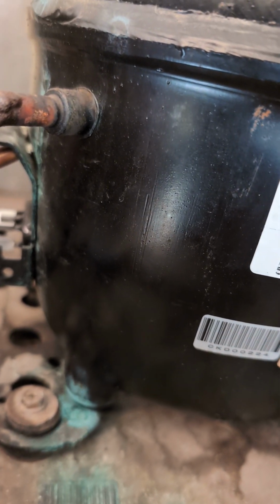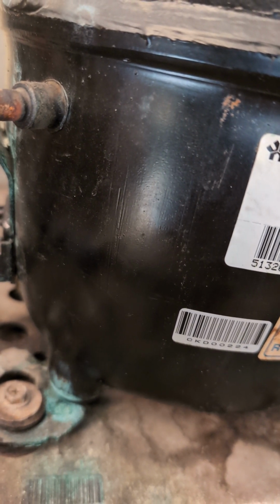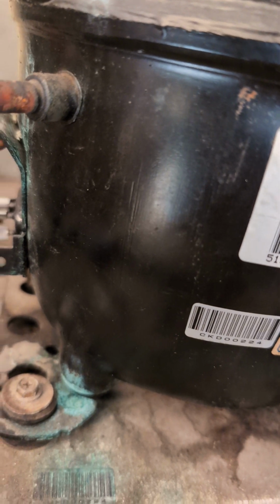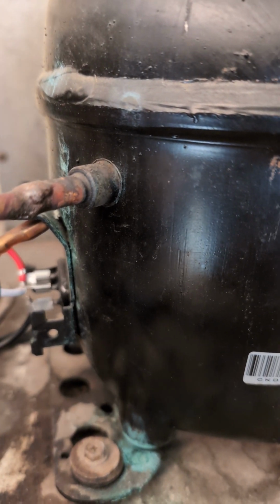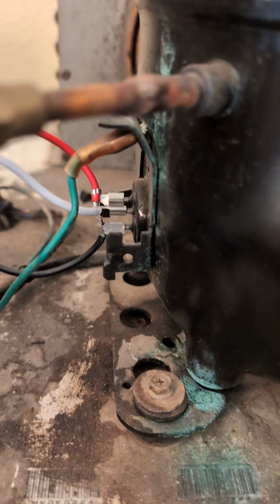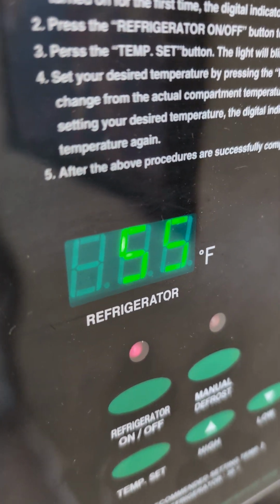But here's a little information. There's a site called outforgrabs.com, and you can actually get a capacitor that is similar to this, but it has a connection that just snaps on there on all three. So it's got the three holes, and you don't have to worry about bad contacts and shorting the compressor or anything like that. So that'll work pretty good for anyone. Down to 55.